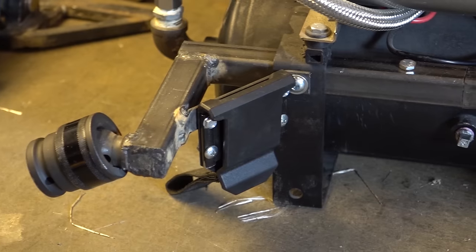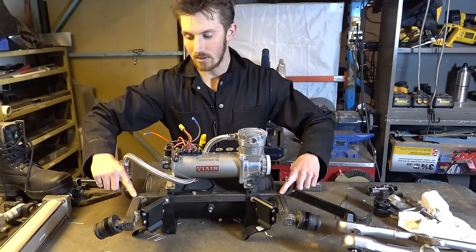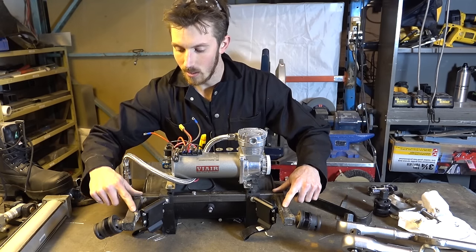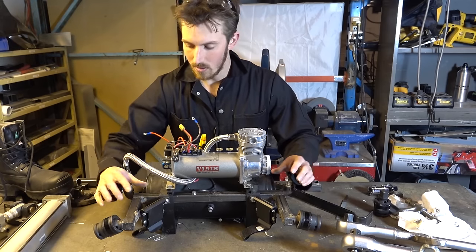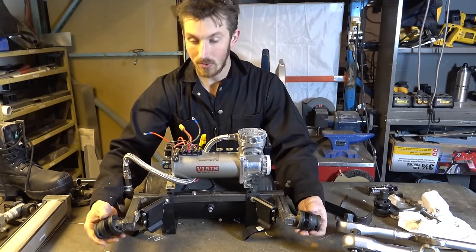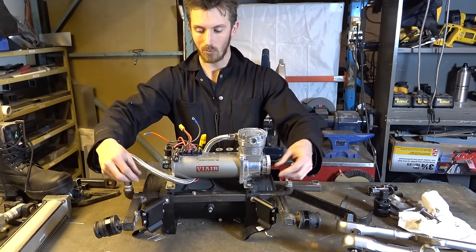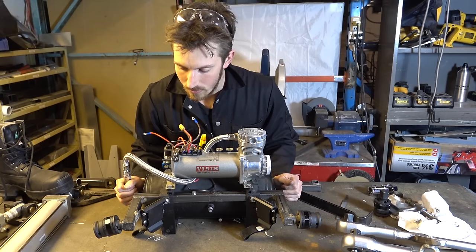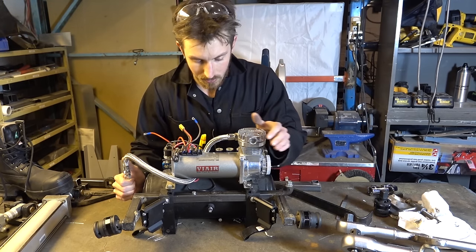Alright, so we've redesigned the hip mount, and as you can see it's a bit stronger. We've gone with a straight 90-degree angle for the main weldment, but then we've added two smaller pieces to attach the belt onto. The main reason we did this was to add the hip mounts right here, and then also we're going to be building up the back support from this weldment. So once we finish those legs, we're going to put it all together and try taking a little walk with it.